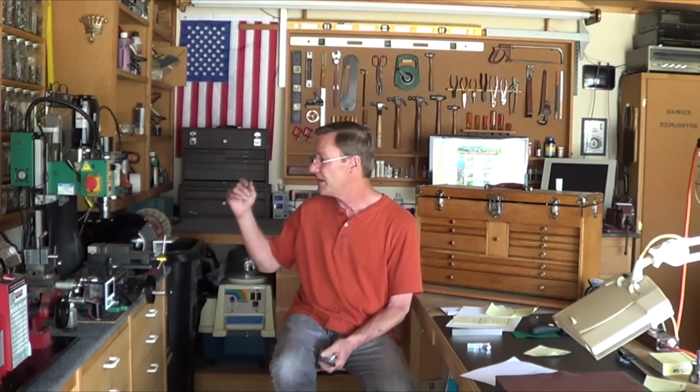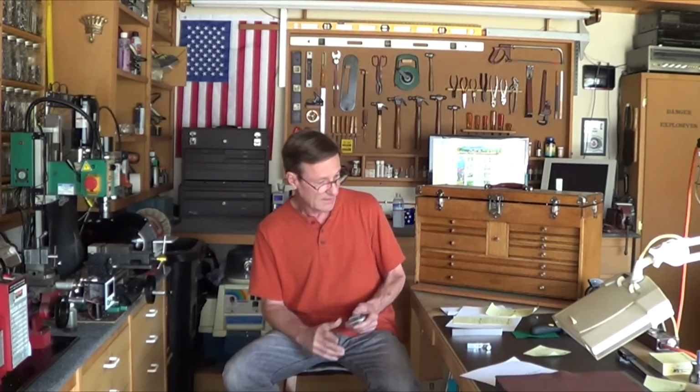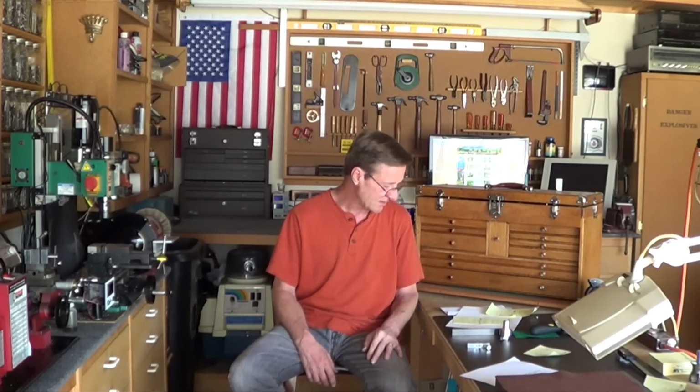But what I was doing is what I see everybody doing on YouTube, even the big machine shops. They'll move the table, the edge finder snaps, and they'll zero out the DRO. That's incorrect, because when it snaps, you're a thousandth over. So you're supposed to let it snap back up a thousandth, then zero out the DRO. Once I did that, I was getting better results on these insert holders. So just a little heads up.